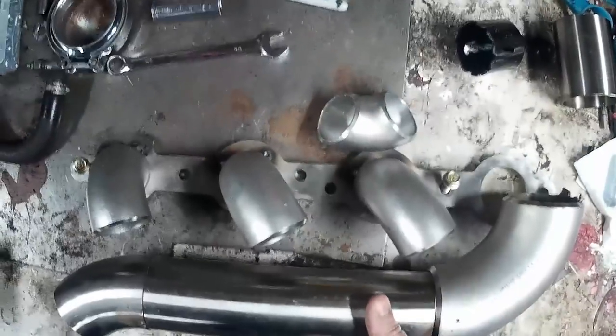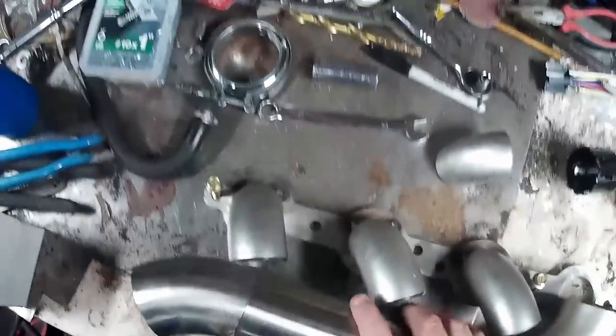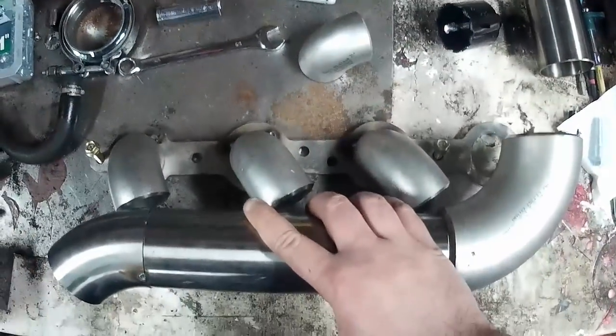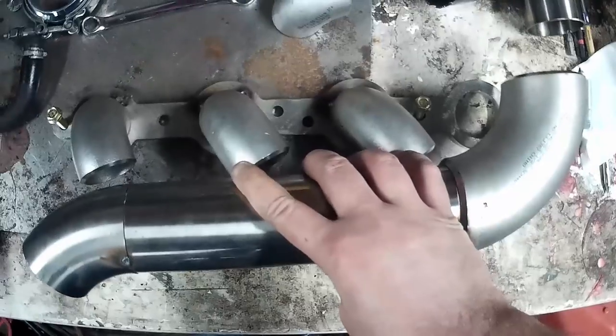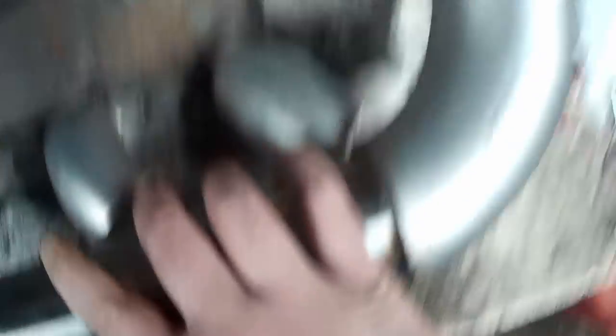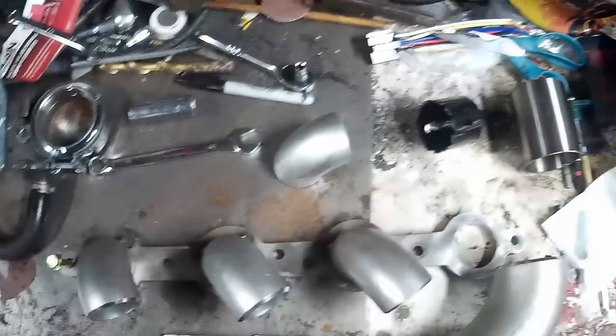Let's go ahead and recap real quick — so what do we have for the day? We have the general outline of what this log manifold is going to look like. This may not work — I may need a straight pipe, but we will see, because it's looking like I want this to line up so that it hits right before the schedule 40. I don't know if that little weld L is going to be able to bridge the gap between the 90 and this or not, but we'll find out on the next episode. If you guys have any questions be sure to ask. Be sure to like and subscribe and share with your friends, and I appreciate you guys watching — until next time, thanks again.